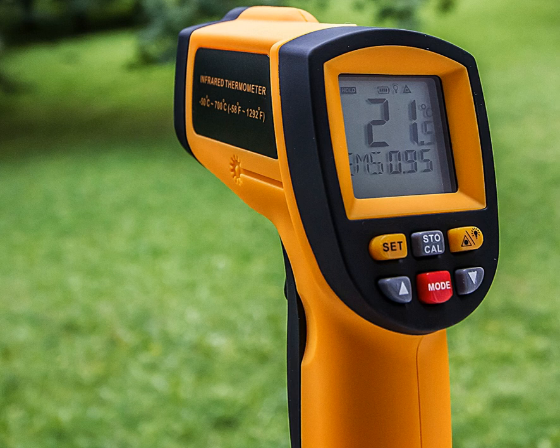Infrared thermal imaging cameras are essentially infrared radiation thermometers that measure the temperature at many points over a relatively large area to generate a two-dimensional image called a thermogram, with each pixel representing a temperature. This technology is more processor and software intensive than spot or scanning thermometers, and is used for monitoring large areas. Typical applications include perimeter monitoring used by military or security personnel, inspection, process quality monitoring of manufacturing processes, and equipment or enclosed space hot or cold spot monitoring for safety and efficiency. A photographic camera using infrared film and a suitable lens is also called an infrared camera, but it only captures the near-infrared and is not sensitive to the thermal radiation from room-temperature objects.